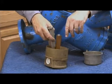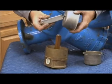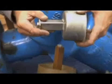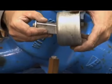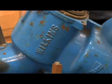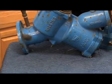The tube replaced the sharp brass one, and the spring retainer also had a rounded cup, so that it would slide easier as it moved up and down as the check assembly moved. It had more tolerances where it could move sideways and not hang up like it did on the original version like this. So either version you may find out there.